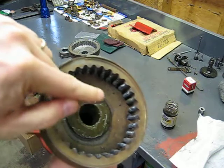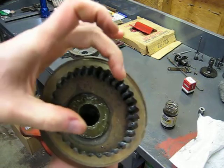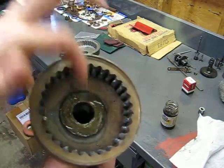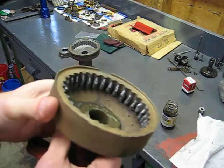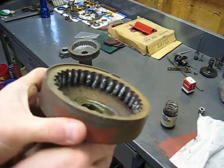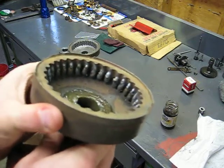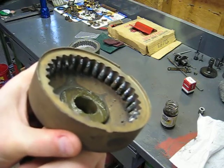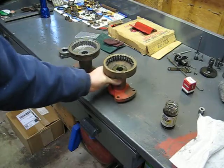And then just before I put a little bit of bearing grease around the paw area and down in the first bushing or axle area. That way the slag doesn't actually stick to it. But as you can see right there, I just go right around and just snot each tooth with the welder. I just have a Weld Pack 100 Lincoln MIG welder, and that's what I use. I use a MIG welder on cast iron. I know people are gonna be like, you can't do that, but I've done it.